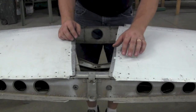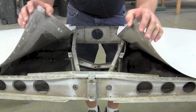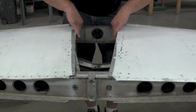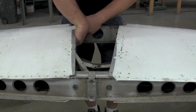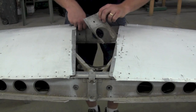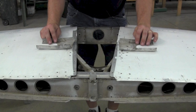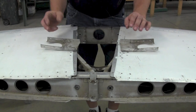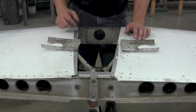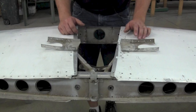Once you have that done, drill the rivets along the rear spar — you can open this up to gain access. Then you will need to remove the ribs inside, and also remove the doublers that were put in there originally, which did not go all the way through the spar area where you have issues with cracking and stress marks.